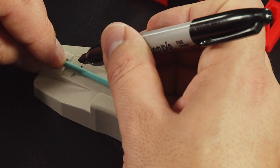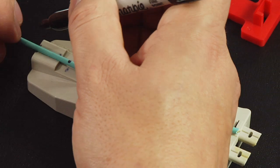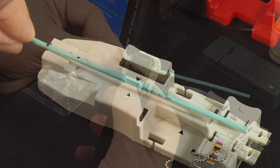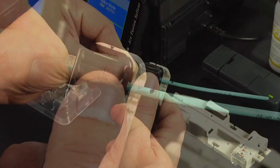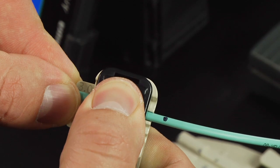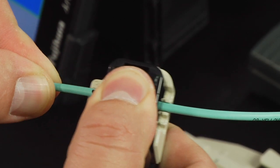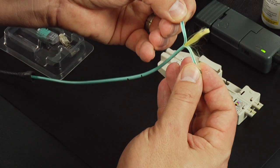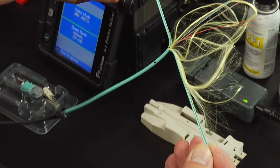Place the end of the cable at the end of the ribbonizing tool and place two marks on the cable at the other end of the ribbonizing tool. Place the marked cable onto the cord splitter tool and slit the cable jacket.